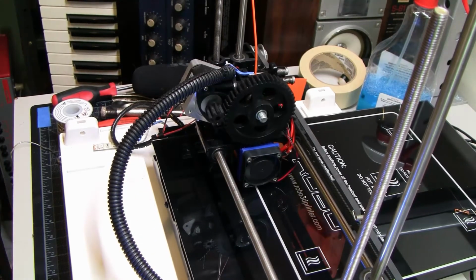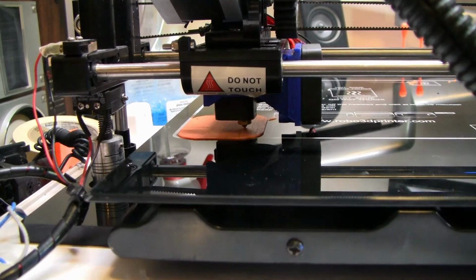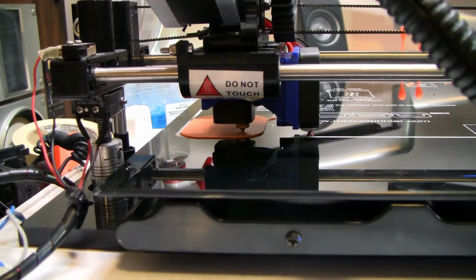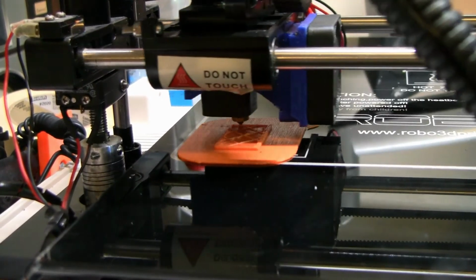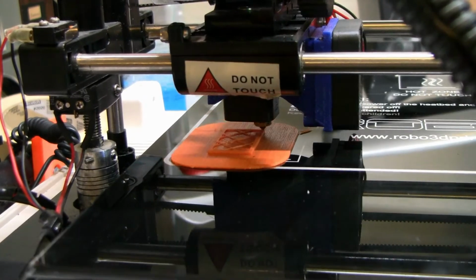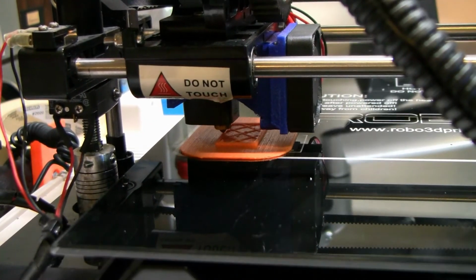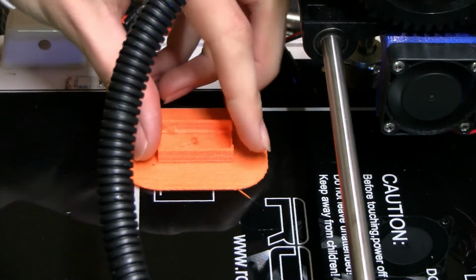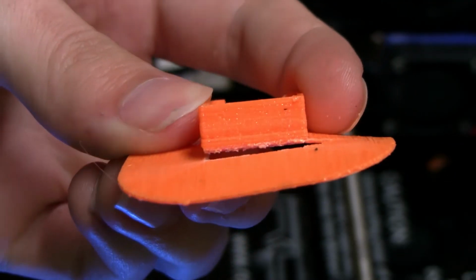don't appreciate that. I was also shocked to find that after it started printing the structural stuff, even without a part cooling fan, this way too hot PLA was bridging acceptably. The part doesn't have any holes in it. It doesn't have any weird under-extruded mesh, so that was pretty impressive. Ultimately, it did have this kind of foamy, fuzzy looking surface, and that's just due to the heat. It was just far too hot.